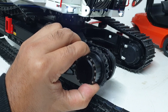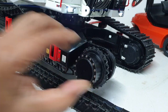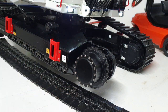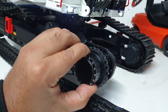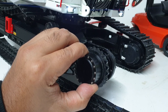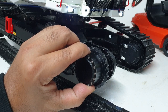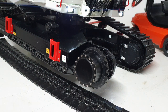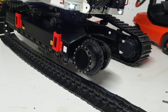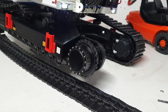There's a lot of torque in there — I can't really hold it with my hand. Under load this track seems to perform pretty well, but without load it's a bit erratic. At least I can hear the pump RPM. It looks pretty normal, though it doesn't sound entirely normal — this is the first time I've actually run my pump at such a high rev. What I'm trying to show is there's a lot of torque on these hydrostatic drives and it pretty much simulates the real machine. Every once in a while it's good to give it a clean with compressed air to remove all the fine grit inside the tracks for better longevity. That's all I had to share — if you have any questions or remarks, let me know. I'll stop the hydraulics and catch you on the next video. Thank you for watching.